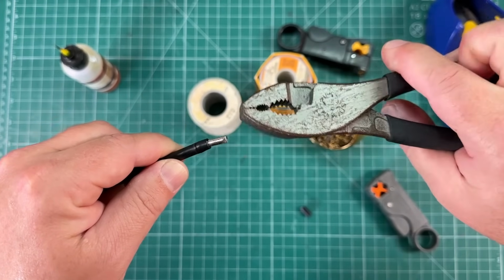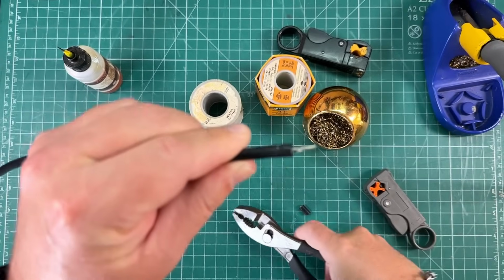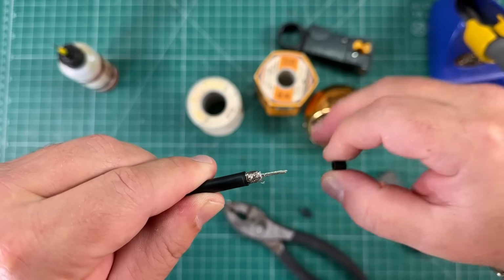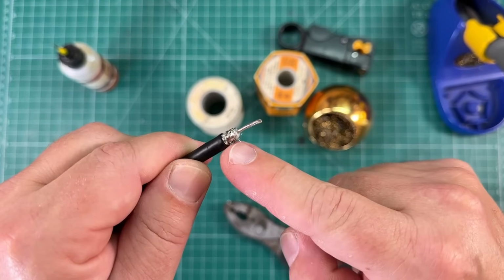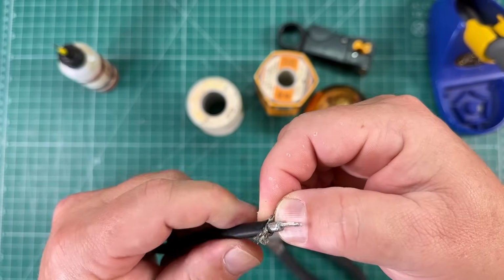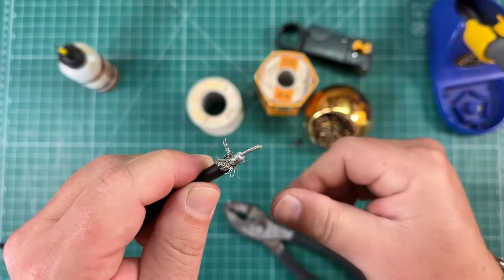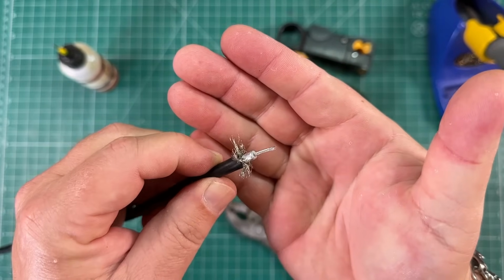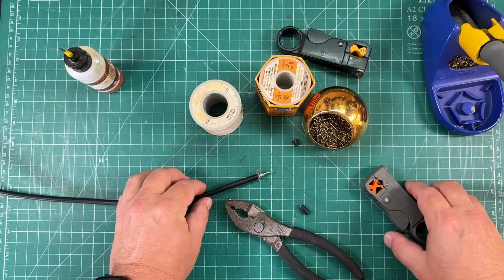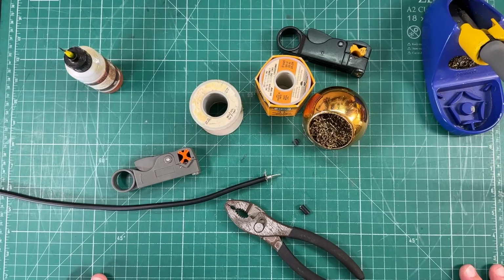Now, if you have problems with dexterity, maybe get some pliers and you can pull off that foam dielectric. So now there's our center pin, and then we can take this guy off because it didn't cut down to the braid and the foil inside there, and you can spread out your braid and then install your crimp connector thusly. So that would be a very good solution for you, and I hope that helps, and good luck soldering. I appreciate you writing in.